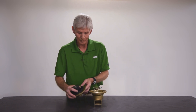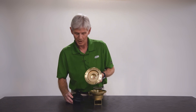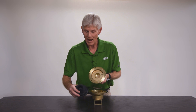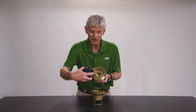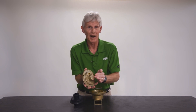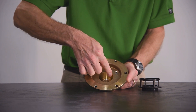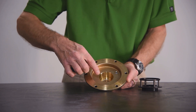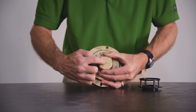I've taken this apart. The first area to look at is within the relief valve cover. This bore internally is a very smooth bore and we have a plunger that rides in there with an o-ring on that plunger. That o-ring seals off atmosphere inside that area. If we get a lot of pitting or a lot of green patina growth — that green coating you get on copper alloys — that will cause the o-ring to leak and you'll have weep hole leakage, with water actually coming out of that weep hole.